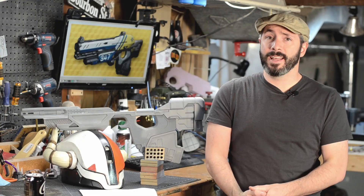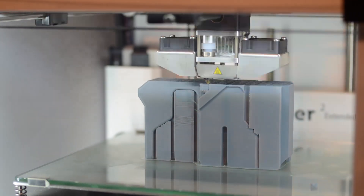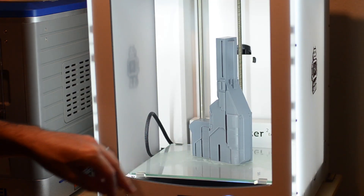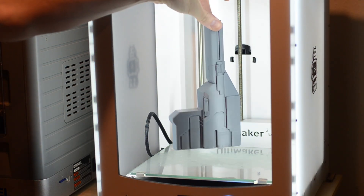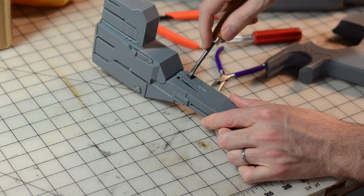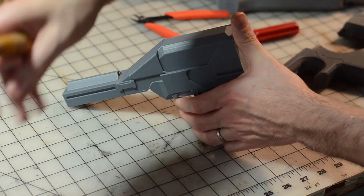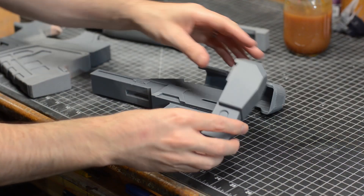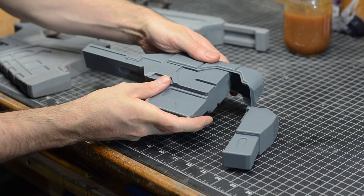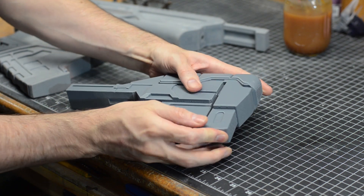The major part I've finished since the last video is the rear stock portion. Like everything on this gun, these parts were printed in the gray Matterhackers Pro PLA. This large part took a good 12 hours to print. I'm a big fan of using support material to make sure all my parts come out with very few issues, and I love preparing my prints in Simplify3D because it makes really great support material that's easy to remove. I printed the stock in three parts and then used the top part as a key to lock the two lower parts together. These parts fit together like a glove with no adjustment to the tolerances between the parts. All I have to do now is get them all sanded up and glued together.